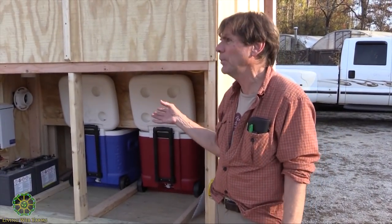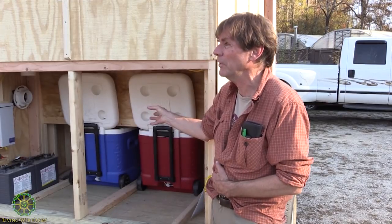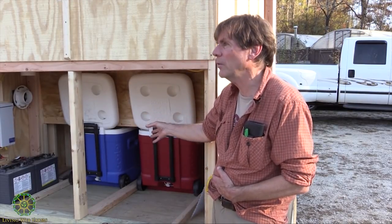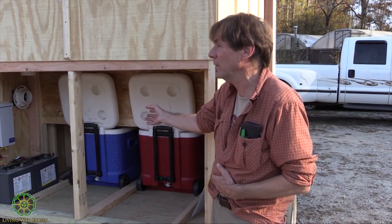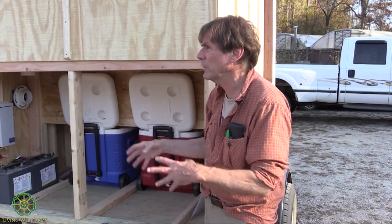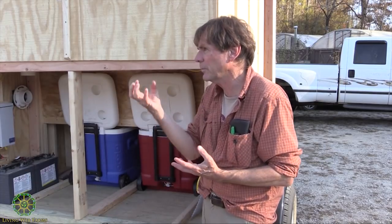Actually there is some composting that will occur. The start of composting will occur, especially in the summer, right in there. Some sources say, oh, nothing, batch systems, there's no composting until it gets out. Well, it will on a hot day in the summer. It could get pretty hot in there. So it will start to compost. So when that happens, it's going to actually fluff a little more. The solid material is going to break down.